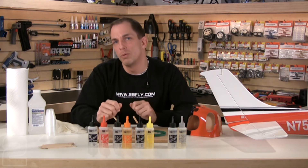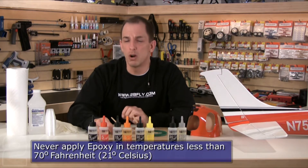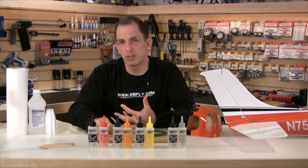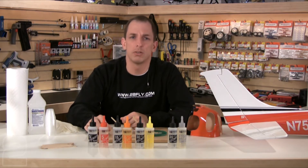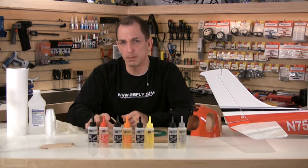Also critical when using two-part epoxies is the material and ambient room temperature. You should never use epoxies in temperatures less than 70 degrees Fahrenheit, with the exception of 5-minute. It creates its own heat during the curing process so you could apply it in a 60-degree room and surface temperature, and it would create enough internal heat — raising it 10 to 15 degrees — to achieve effective bonding. Epoxy applied in lower temperatures may never fully cure, resulting in much lower bonding strength.